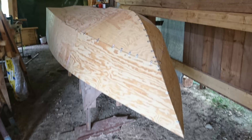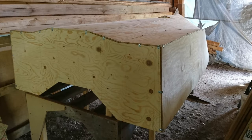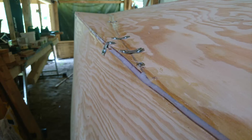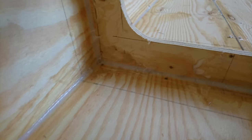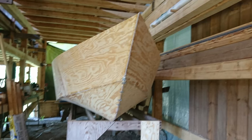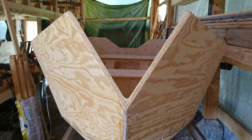Now when all of the hull pieces are attached, all voids and cracks between the pieces must be filled with thickened epoxy. I used a spatula to just jam the epoxy into the voids. I let the epoxy cure overnight and then flipped the boat to work on it from the inside. To strengthen all the joints you need to make epoxy fillets — the round shape helps distribute the forces acting on the joints. The bow is very pointy, so I had to do a little plastic surgery.